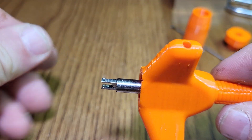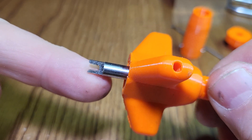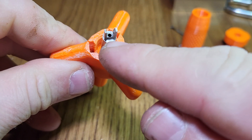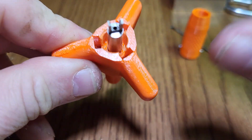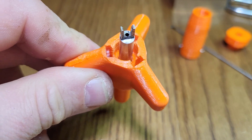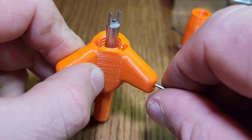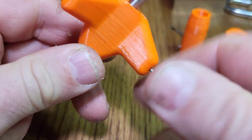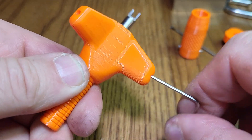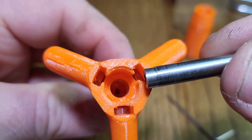All of the work was in the tensioning tip. I made mine from a piece of solid stainless bar, which if I had my time over again I absolutely would not do - it was murder to make. I wanted a 1.5 millimeter hole at the end to act as a support for the pick and keep it completely rigid all the way through. There are grub screws that go down through these holes in the tensioning handle - just loosen those off, it slots down in that hole there and the nuts slot in down these holes here.